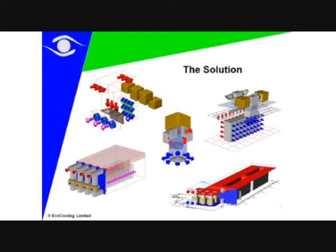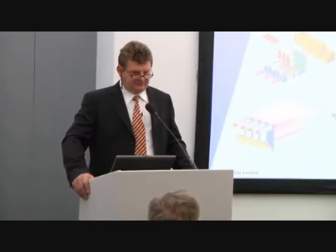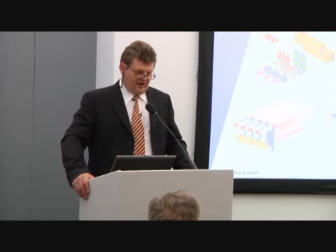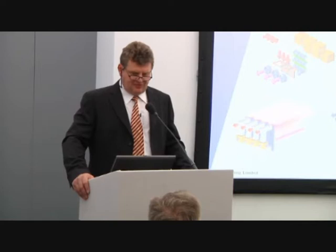The solution for M247 uses modular boxes that fit around buildings as part of a balanced ventilation system. Air is pushed in, sometimes over pads which are dry or wet, providing cooling or just fresh air into the building and recirculating around. Many people have existing data centres with legacy equipment and require retrofit, so we have to have a number of installation methods to implement this.